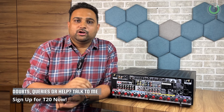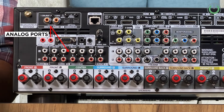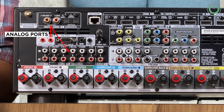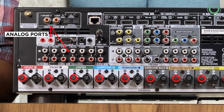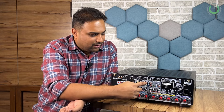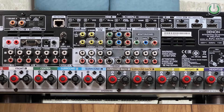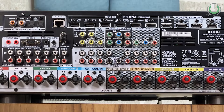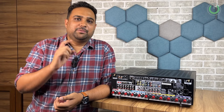The yellow ports are your analog video input and output ports — you will not get full HD or 4K signals through these, just lower-resolution analog video. Just as there are analog video ports, there are also analog audio input and output ports. The audio inputs are used for devices like a turntable or an old CD player — white stands for left, red stands for right. You will also have RGB colour component video and audio input and output ports at the back panel. Not many people use these today, but if you have an old VCR or legacy product, you may need these ports.